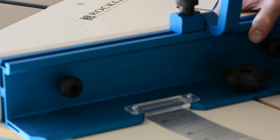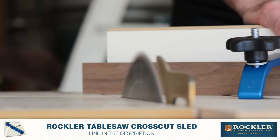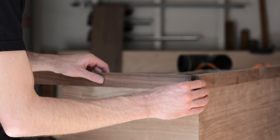For the face frame, I was basically cutting those same angles that I had used on the case, only now instead of bevels, I was cutting miters, which is actually quite a bit easier. So I dialed in my angle on the table saw crosscut sled and basically just worked my way around the entire unit — cutting an angle, marking the opposite end, cutting it, gluing on that piece, and then moving on to the next one and repeating.